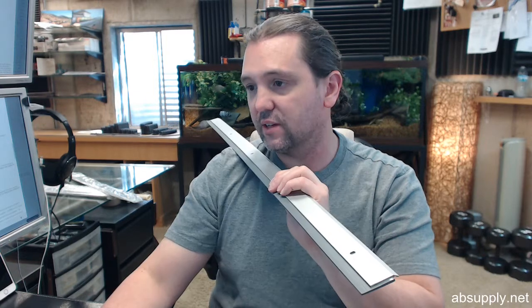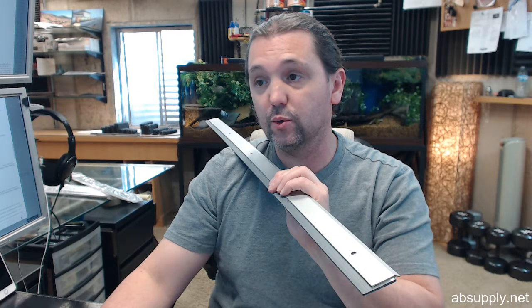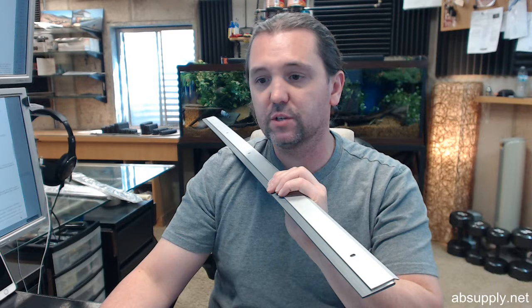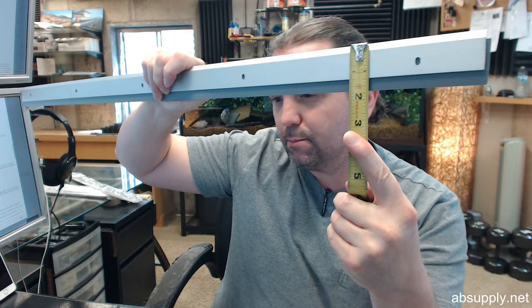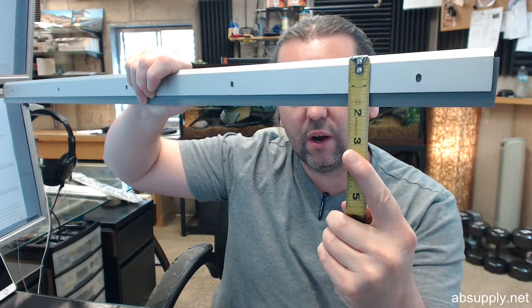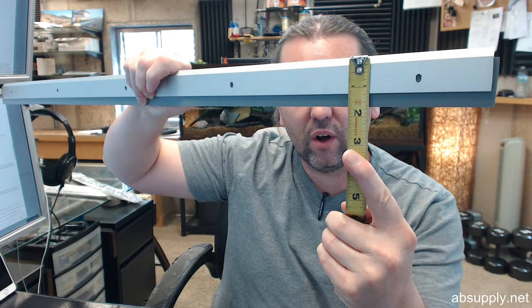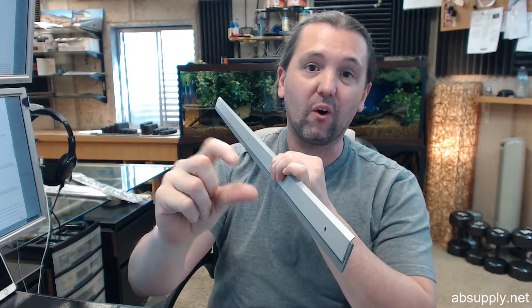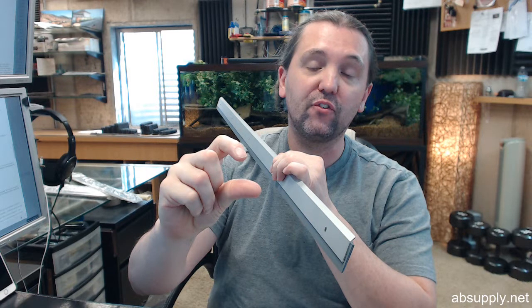There is a link to the catalog and a link to a document called Installation Instructions — measure, cut to length, attach. Dimensionally, there is an image below this video showing the important dimensional properties of this sweep. It is 1 and 11/16 overall height: an inch and a quarter of aluminum, then 7/16 of silicone. The thickness is probably about a quarter inch, maybe 3/16. It is great for a typical hollow metal door installation with a quarter inch or half inch high threshold and 3/4 inch undercut, and an excellent choice for aluminum storefronts as well.